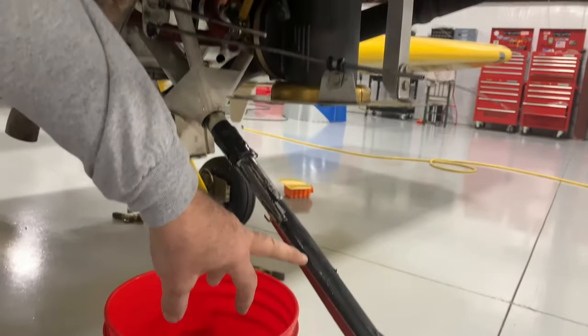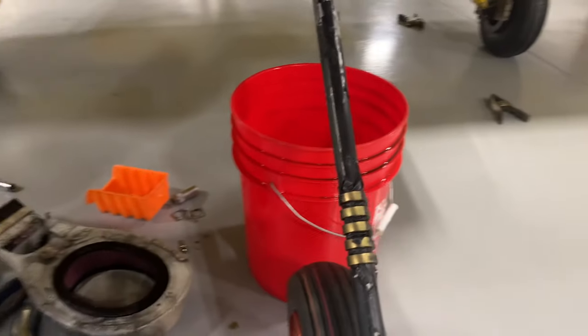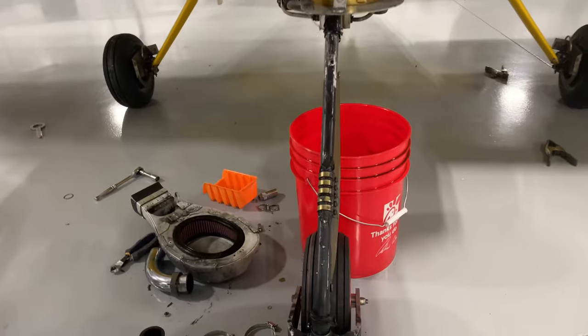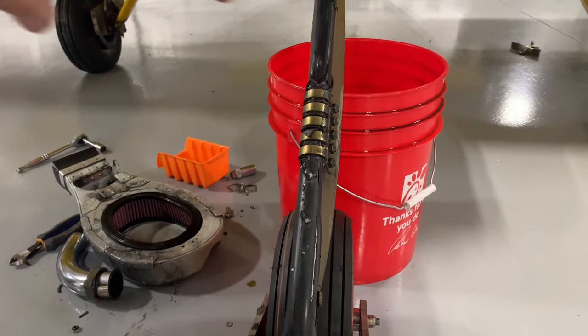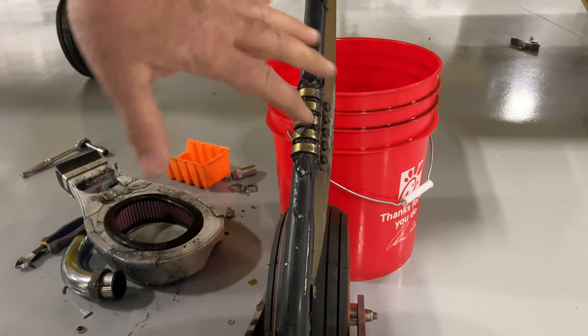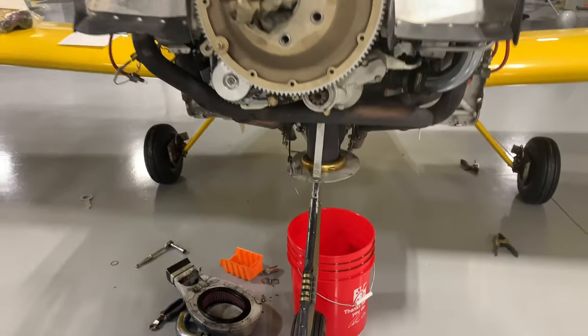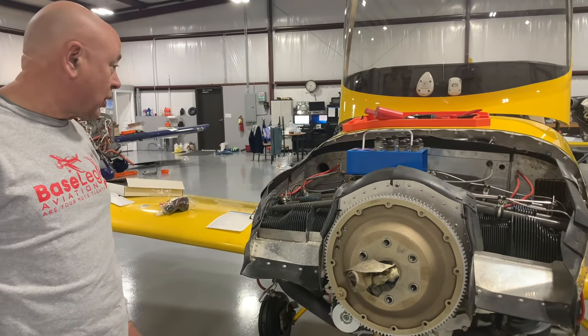Look at this anti-splat aero nose job — that's just sloppy, sloppy workmanship. Reality is I don't know how much good it will do. You spent all this money on something and it's not lined up parallel to the strut here, so it's not going to apply maybe 40 percent of the preventative force when the nose gear tries to turn over.